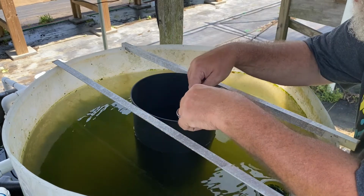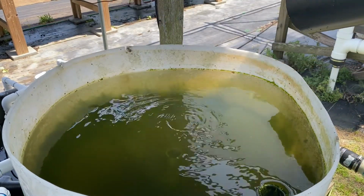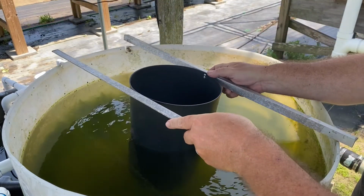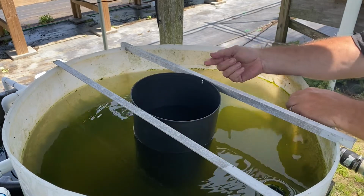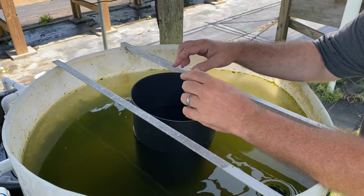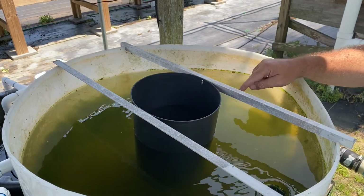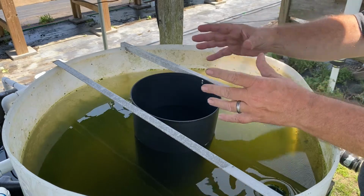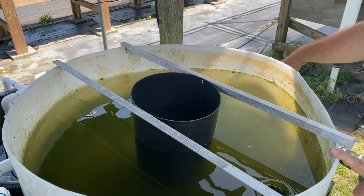So basically what's happening here is there's a standpipe down there. Maybe you can see it. You can see the water bubbling up here from it. That's coming from the solids lifting overflows in the two fish tanks. And what happens is that comes up into this little small area and it bubbles up, and then the fish poop has to go somewhere, and it's not overflowing the top, so it's got to go back down. And then from the bottom of that over to here, you set up a flow where the water's coming in that standpipe, it's forced to go down, it comes up, and then it goes down this standpipe and drains through the filter box and into the sump pump.